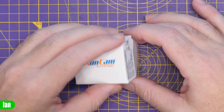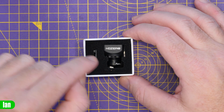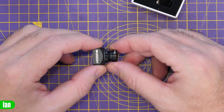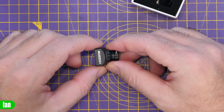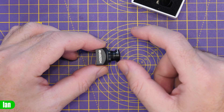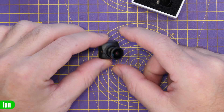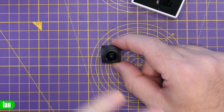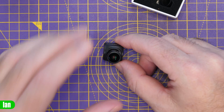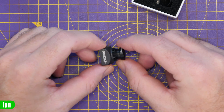To start, we're going to look at the new Micro V3. This is a very interesting camera for me. It is optimized for 16 by 9 aspect ratio and designed to be used with the new HD Zero goggles. It supports the 720p 60 mode but also fully supports the new 1080p 30 mode, giving you a full 16 by 9 field of view with no vignetting in either mode. There is no need to swap the lens, and you would call this HD Zero's first proper 1080p 30 camera.